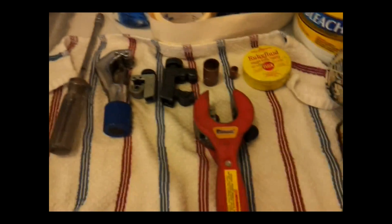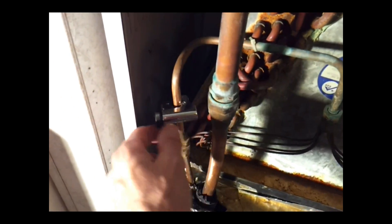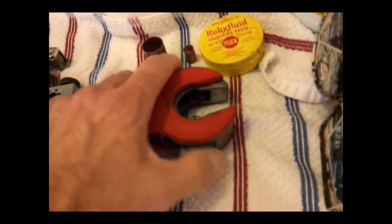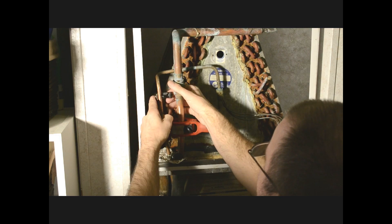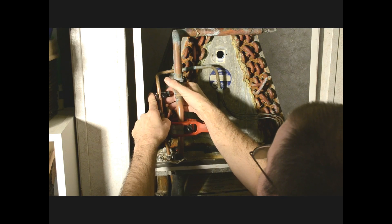The next day has rolled around. My brother's here and we're going to work on cleaning the evaporator coil today. We have a number of things laid out and I have several different pipe cutters. I have a small one, but that's not going to work so good on the larger one. The medium sized one can clamp around it but I'll still be hitting the pipe. I also have a ratcheting pipe cutter — it spins around like a ratchet. The system was pumped down outside from yesterday and everything looks good; it held fine.